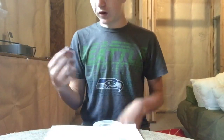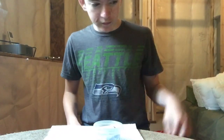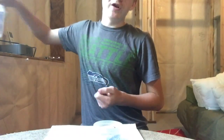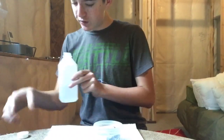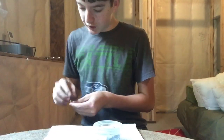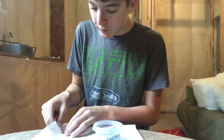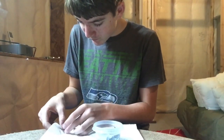All the zinc ions are flowing around in there. I'll have a sacrificial anode piece of zinc that I'll put in, and I'll plate this penny. I'm going to clean it off real quick with rubbing alcohol on a paper towel to get all the finger oils off, because that'll make the plating not stick as well.